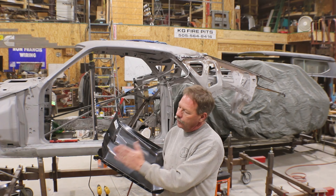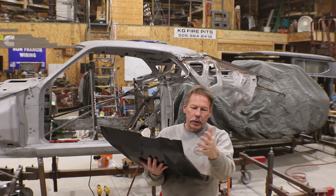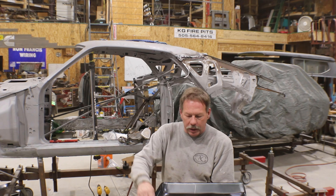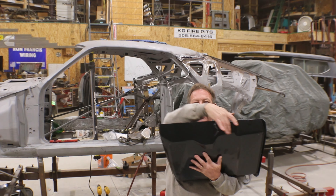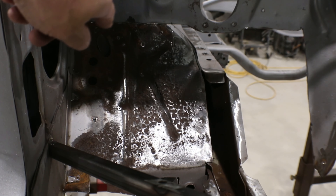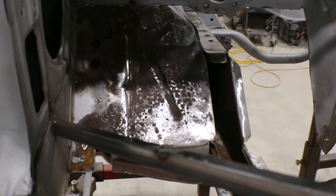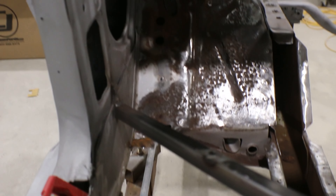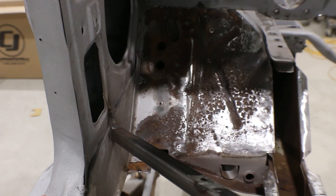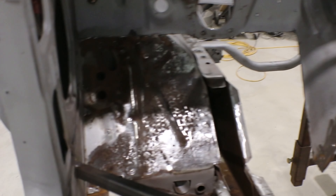This fits flush to the floor with surface material that's below it and it gets welded to it. They've also put a little kick-up over here, so the dies they've used are basically incorrect. So I'll be cutting the flange off up to where they bent it, but when they bent the flange in here they also kind of kicked it in, so we've got to straighten all that out and realign everything so that we can cut it off in the right place. I need to take about three inches off up here to fit what I've already cut out. With that in mind, I'm thinking we're going to order one of those panels as well - we could make it, but it's probably 16 or 14 gauge metal and putting all those bends in there would be pretty time-consuming. And I'm assuming since that one's rusted out, the other side which has just one or two smaller rust holes will need it as well.